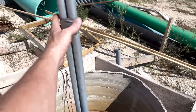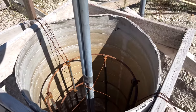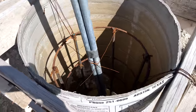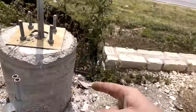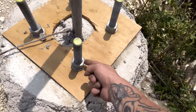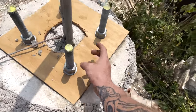The process of how you prep a pole: you put the sono tube in place, then you build some rebar — a rebar structure like rings that are all connected inside. That's going to keep that concrete really hard so it doesn't start cracking and breaking apart. Then you have to put anchor bolts inside of it. The anchor bolts can be 18 to 24 inches long, usually like a one-inch bolt, and there's four of them that get put down inside of the sono tube.